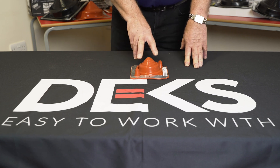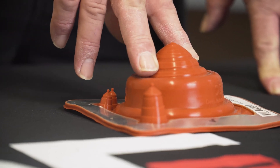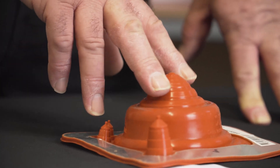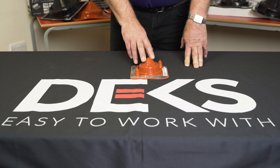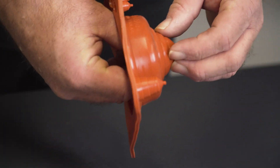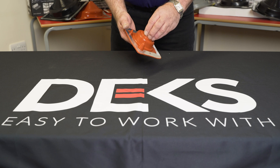It's important to note that you should never pass the insulation on your solar thermal pipe through the Decktite. You must cut the Decktite to the size of the inner pipe and then sandwich the insulation underneath and over the top. The Decktite is not designed to seal on the insulation.